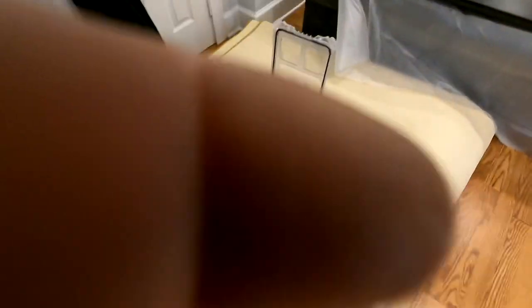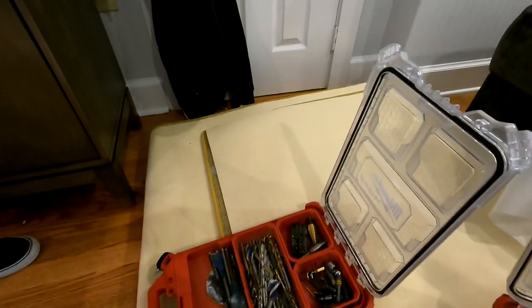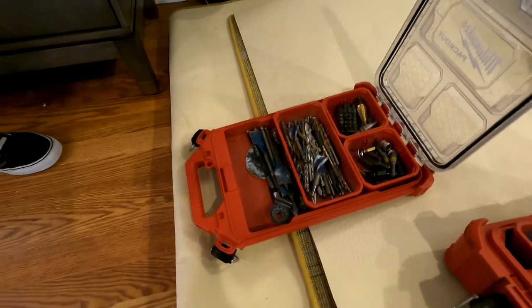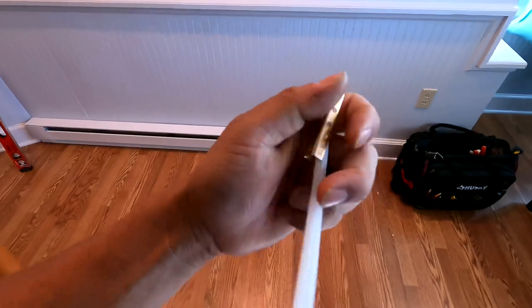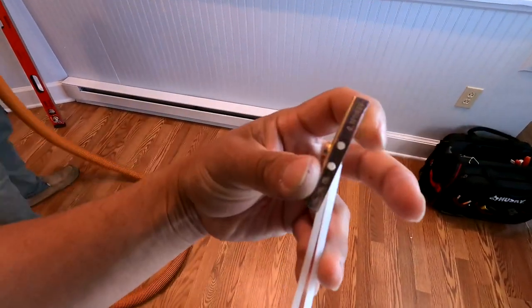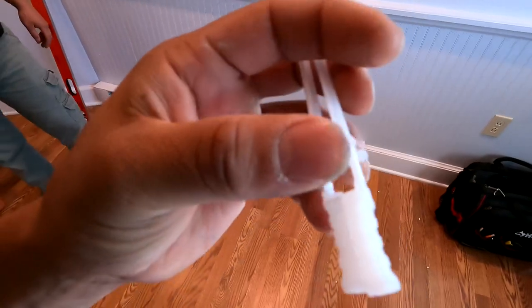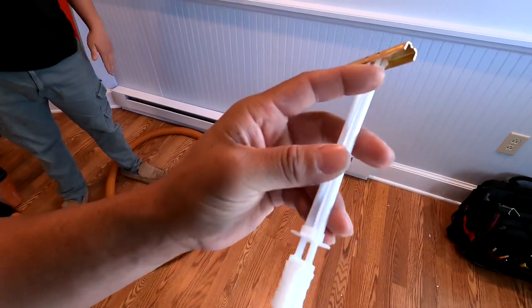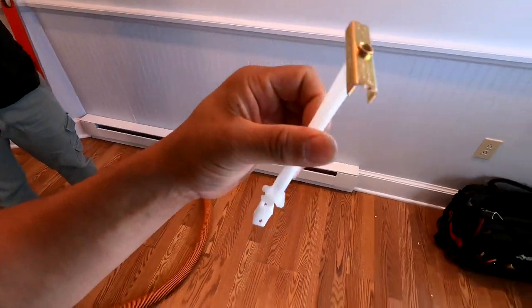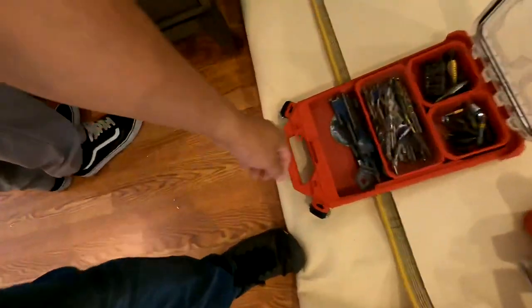We're getting our hardware ready. We'll drill a half-inch hole for the toggles. Basically you drill a half-inch hole, shoot the toggle into the wall — it goes in flat — then you pull it back and it extends. You pull and push simultaneously so the wings bridge to meet the wall and grab it real good. These things hold a lot of weight and are awesome. Let's get a good look at how that works.